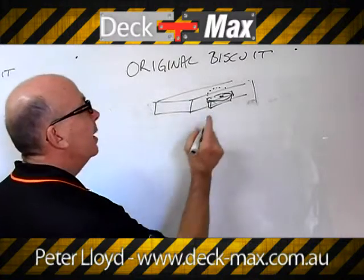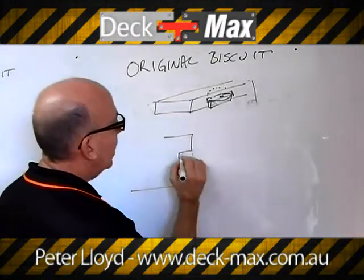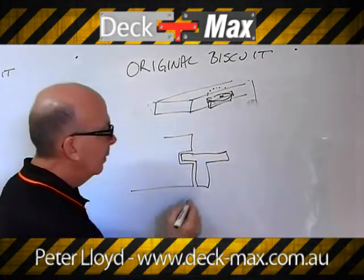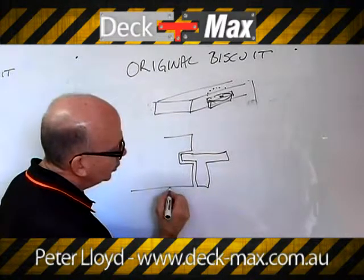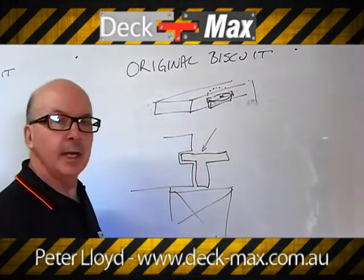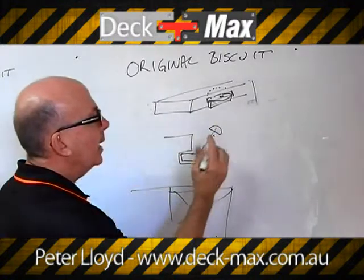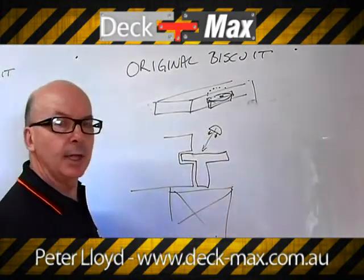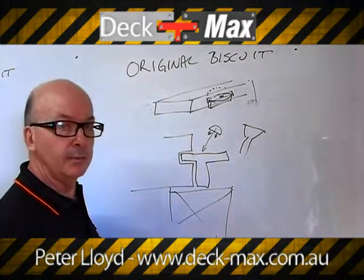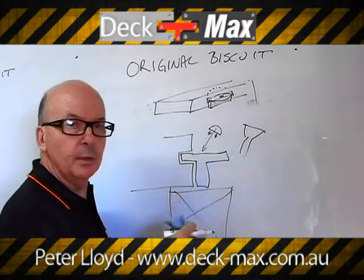The biscuit fixing system has a little step in the process — this goes back to just an installation idea. The board will have a groove in the side of it, and you insert the biscuit. It has a leg on it in a T-shape. That leg will be flush with the joist material. You fasten the screw at approximately a 10-degree angle. The screw has a pan head, so the downward force on the underside of the screw head is extremely strong. If you use a countersunk screw, which is terrible, it'll just drive through and it's very weak. Please make a conscious decision — the pan head screw over a countersunk screw gives you insurance.